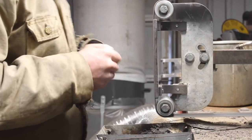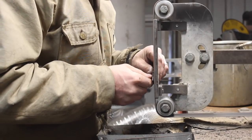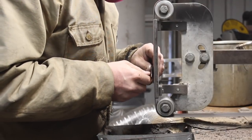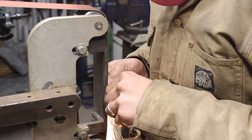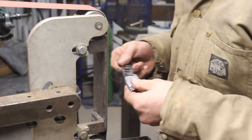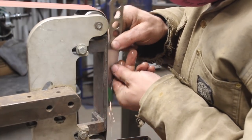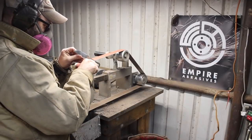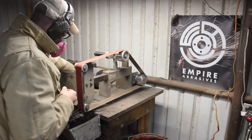So we've got it tempered up and ready to finish grind. So finish grinding in the bevel, and then of course the entire surface of this little blade, handle included. Because we're etching out this Damascus pattern, we have to make sure that the decarburized layer of steel is completely ground away everywhere. If you leave that on there, it would... actually there's a little spot right at the very end of the knife that I didn't grind off because the corner was kind of ground away a little bit, and you can see just a tiny bit of what looks like a grainy surface.